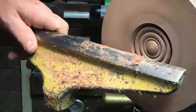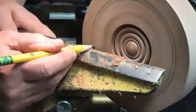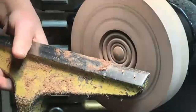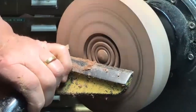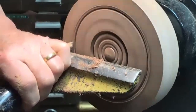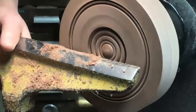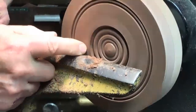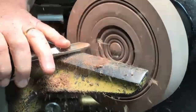I want to come out and make sure I leave enough room so we can cut the bottom off - somewhere around that area. I'll raise my tool rest because I'm farther out. Now I put a little bead in here, setting myself up for a cove one way or the other. I'd rather cove in because I don't want that bead sticking out too far.